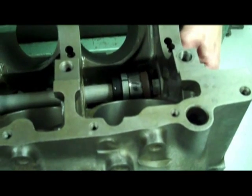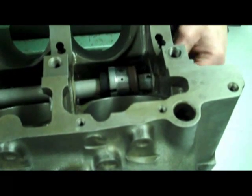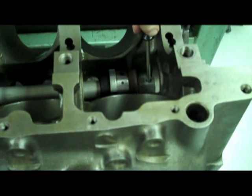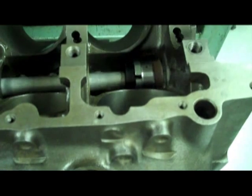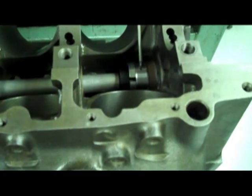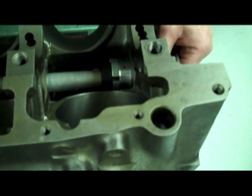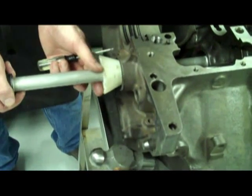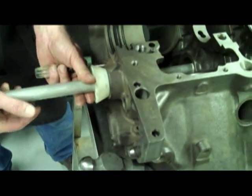So here we go. We're going to expand the tool and hold on to the bearing. To help tighten the tool I can put a pin punch or a small screwdriver in the tool. Now I've got it expanded. I've got my oil hole at the 12 o'clock position that's going to line up with the oil passage that supplies that bearing with oil. Back here on this end of the block I've got a cone, and the cone allows me to keep the tool perfectly centered in the bore while I'm driving that cam bearing in place.